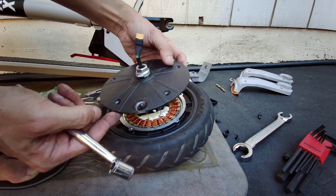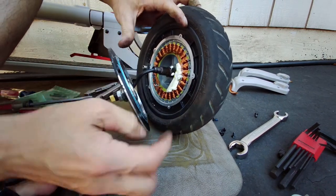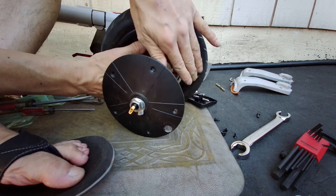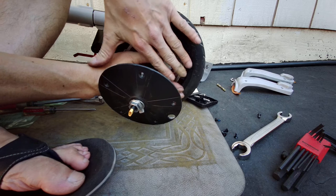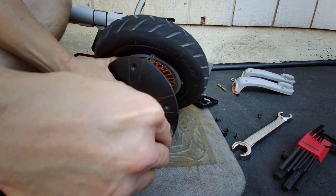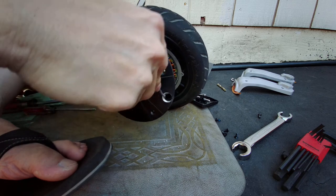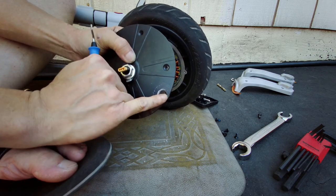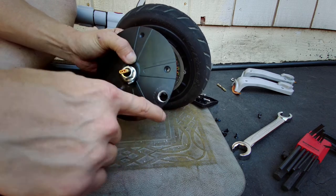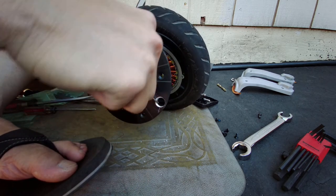When you do this it's a good idea not to get debris into your stator. Good thing is this is aluminum and these are magnets, so the aluminum is not going to stick to the magnets. You probably want to get some painter's tape or saran wrap and just cover this up so that way crap doesn't get in there. This tool basically just goes like so and reams around like that. I don't really want to ream this outer side — it's the inside half I want to work on. Each time I go around when I get to the outside half I don't put any pressure, then on the inside half I put pressure.